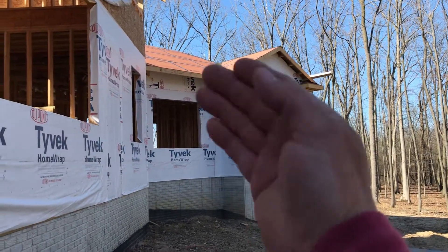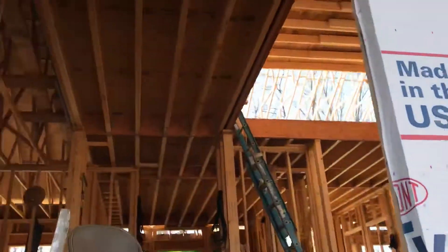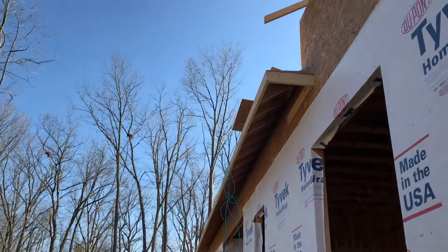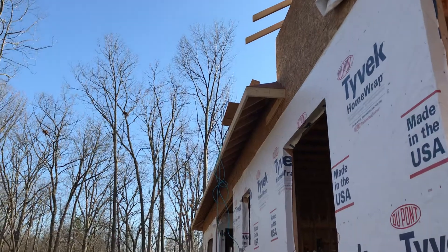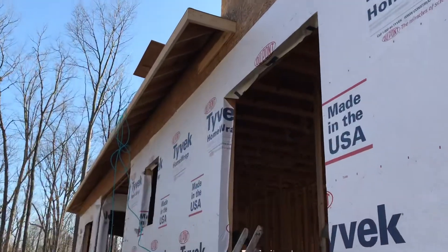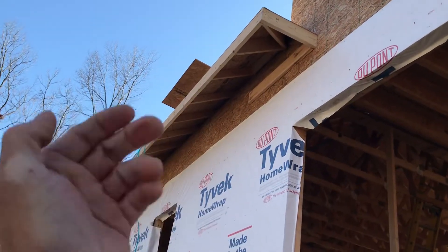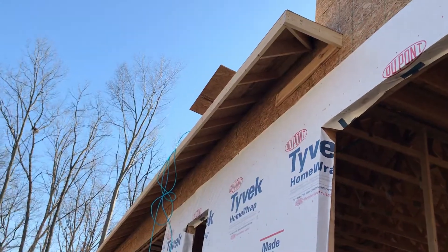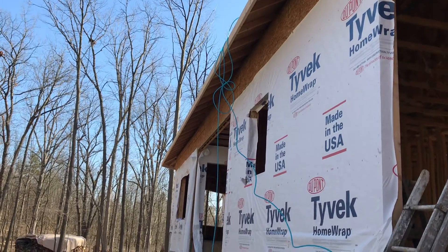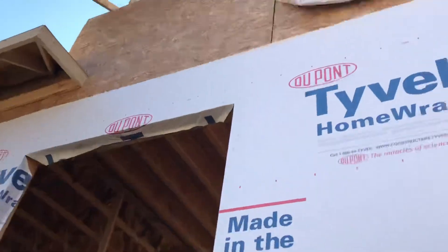We took half of what sticks out and just hipped it straight off the wall. I think it looks pretty good. Then I went ahead and slapped the ledger in there, and we'll just continue that along and start running the blocks every 24 inches. You just shake hands with the rafter tail, shoot it into the ledger board — that makes it super strong. It turned out pretty good.